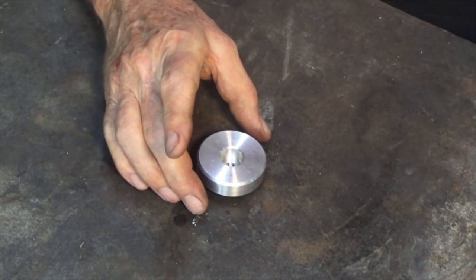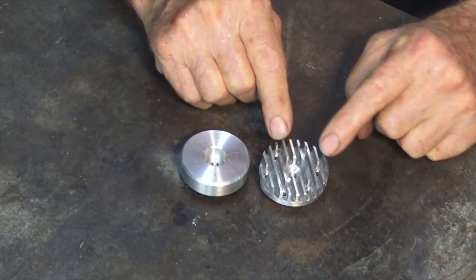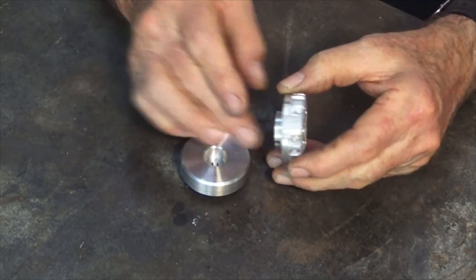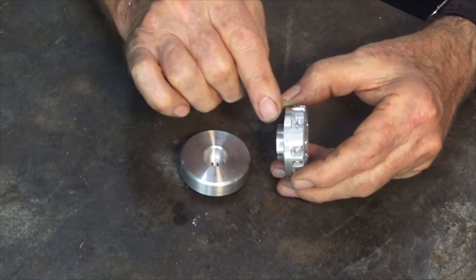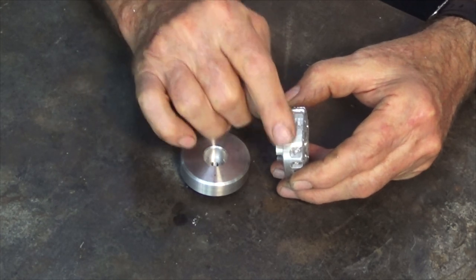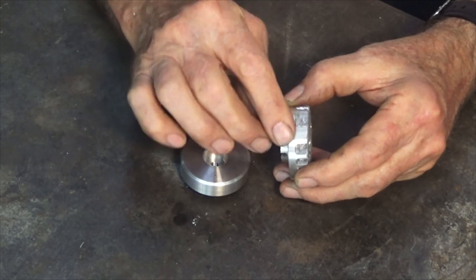We also need to machine a series of grooves which will create the cooling fins in the top of the cylinder head, and there needs to be a groove machined on the underside that clears the baffle on the top of the piston. So that's what we're planning to do today. Now, in the last week or so, I actually tried it out on this part here. This was the casting that was supplied with the kit. And unfortunately, this was scrapped because somebody had cut the gate off the casting and cut it too close to the finished size of the cylinder head.